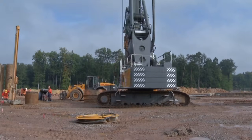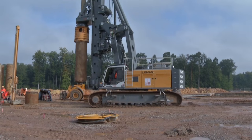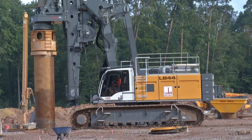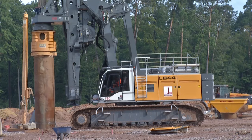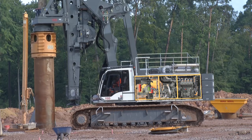The LB44 Rotary Drilling Rig has been designed for drilling diameters of up to 3 meters and drilling depths of 92 meters. The rig is driven by a V8 diesel engine offering 505 kilowatt and complying with the exhaust certification stage 3B.